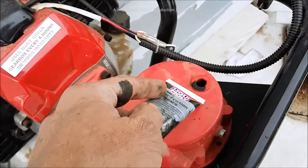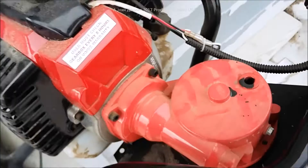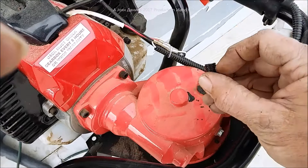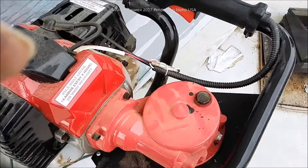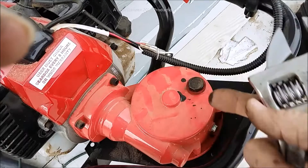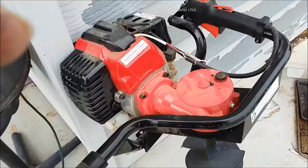This thing wasn't digging well because it was low on oil and it needed to be treated the same way I've treated my pickup truck. Now put your cap back on, grab a little bit of the lube, put it on that plastic seal, and thread it back in. Just bump it gently — 15 foot-pounds is the max that plastic gasket can handle.